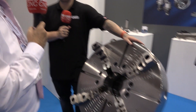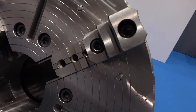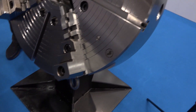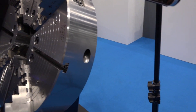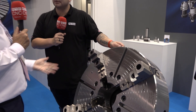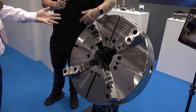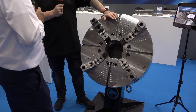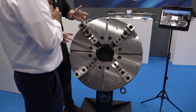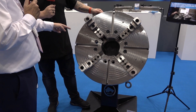Brand new — this is called the True Force Chuck. It's like a standard independent chuck, you do it up conventionally, bring it forward, but then by the side here you can put another key in, turn it, and it gives you optimum force — that's why it's called the True Force Chuck. You're not just clamping once, you clamp it by hand and then activate this, giving you up to 600 deca-newtons of force. With a chuck this size, the workpiece you're going to put in is going to be worth a lot of money or a lot of time and effort — so if it slips because you haven't tightened it enough, that is a big problem. Now you get it all in one.